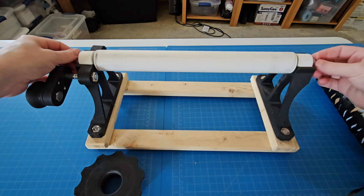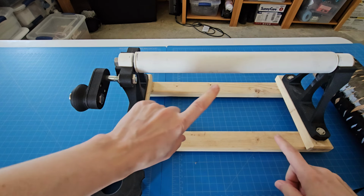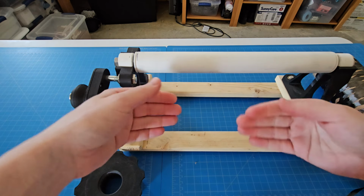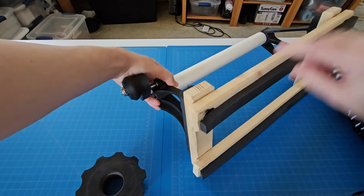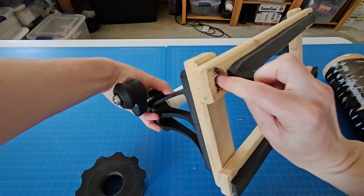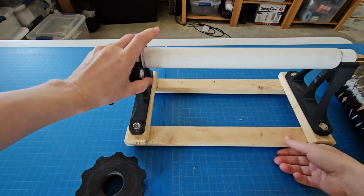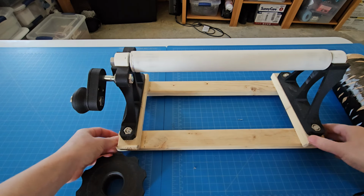So with this type of thing, vibrations are a big deal. They will untighten things. So that's why on my other versions, I have lock nuts for anything that's getting a lot of vibration. You can see the same concept. This is bolted through the bottom with the head recessed. Same themes, just improved in the new version.